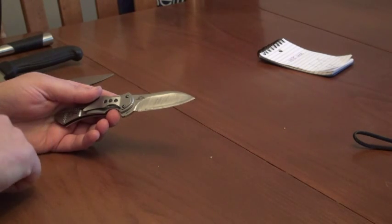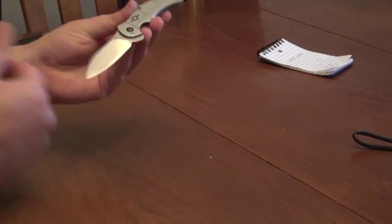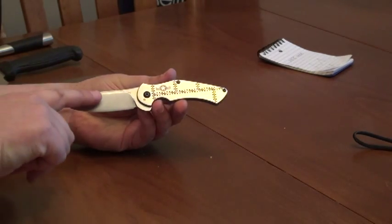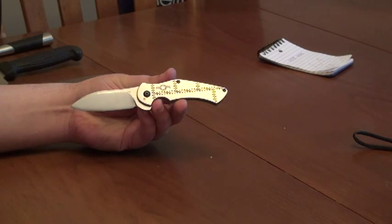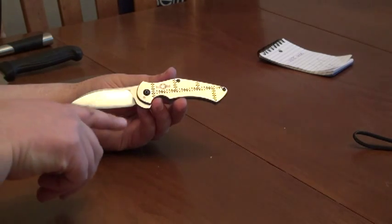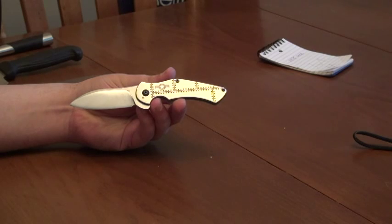What I've done, partially already, and will finish shortly to resolve that problem, is to re-grind it. There's the finished side, re-ground. You can see the primary bevel now goes straight down into the edge, which is less than five-thousandths of an inch thick. This very narrow edge bevel will sharpen much faster, so the efficiency will be much higher.